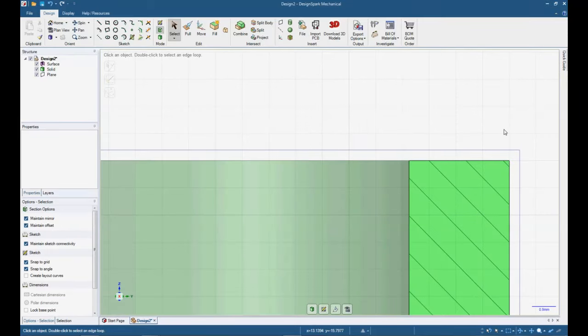Now what we're going to do is design a tool. It's going to work kind of like a lathe. We're going to revolve that cylinder while we pull through a tool that we're going to make here. It's just a little triangle, and we'll pull it through at a specified pitch, and that's how we're going to make the threads. And this is really easy to do.